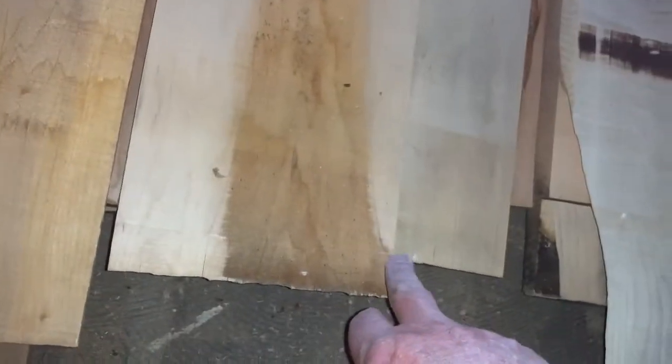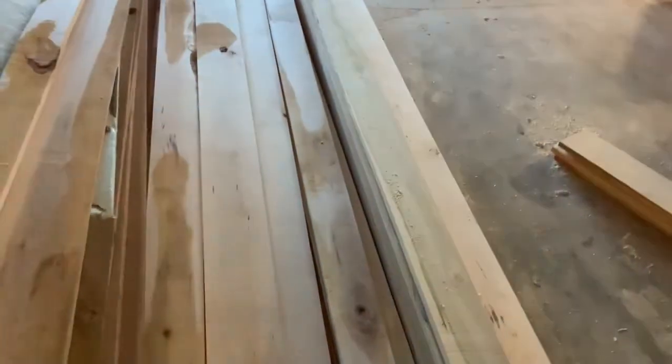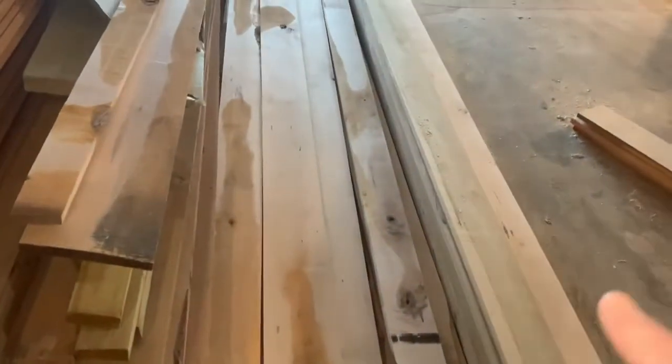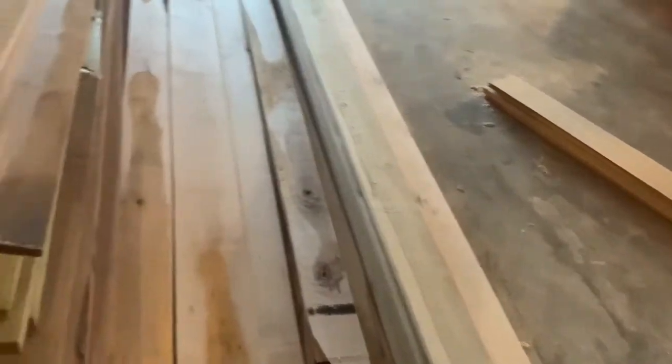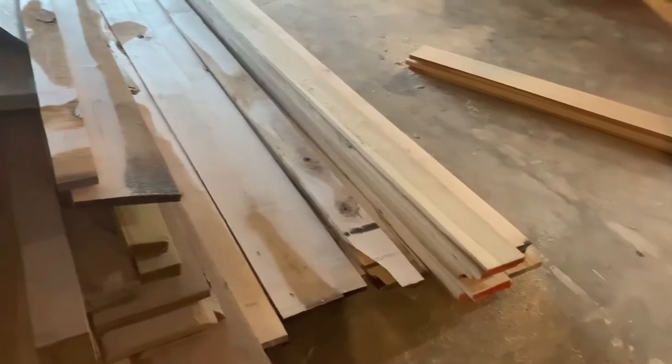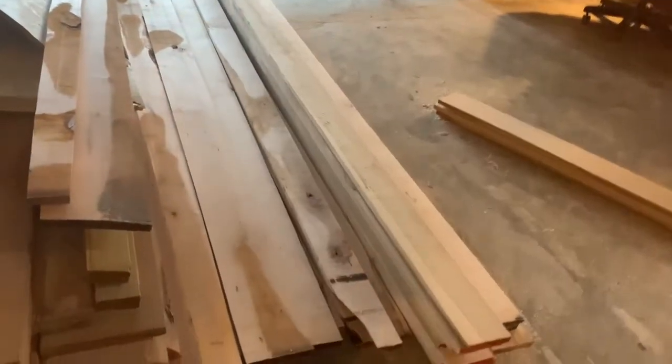This is my hard maple. For instance, if I was cutting on this board — which goes from here to there, five and a half inches, which is what my baseboards are — it's going to leave some amount of this board left over. If it's one and three-eighths or more, I'll use it as a back band for doors or windows. If it's less than that, I'll use it as back band for my MDF wainscoting. I need 53 one-by-sixes for my baseboards, and eventually they'll get planed down and routed.